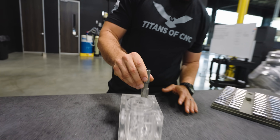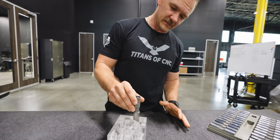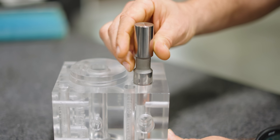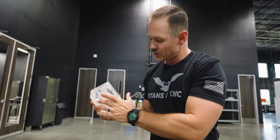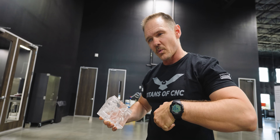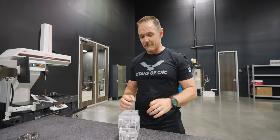The part is warm to the touch. Before, the .8750 pin required a little effort, but now it drops all the way to the bottom easily. We'll take it up to the .876 pin — once we get it lined up, it drops right in almost just like the .8750. This pin wouldn't even start before we put it in the car. Now, a common misconception is that thermal expansion will cause holes to shrink — because we assume that if all this material is growing around the hole, it will push and shrink the diameter. But that's not actually true. What really defines a hole is the circumference going around it, so each point of that circumference expands outward, giving us a bigger hole.